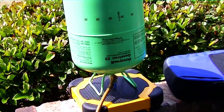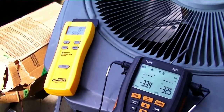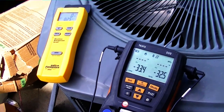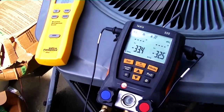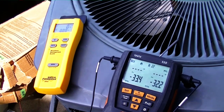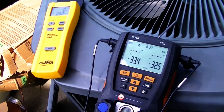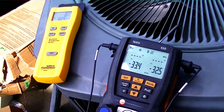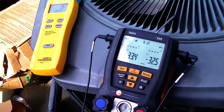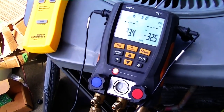We're about to put our refrigerant in — five pounds eight ounces, weighing in liquid to the liquid line since it's a bit faster. We're going to try to get all five pounds in there, then we'll charge the rest for the line set, since the line set is about 40 or 50 feet long. The service facts aren't here but I can remember pretty much what Trane suggests. I'll charge it up step by step to get a little bit closer.